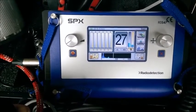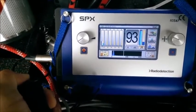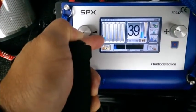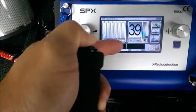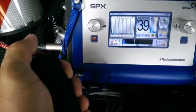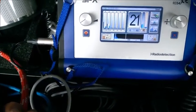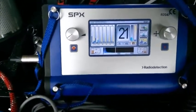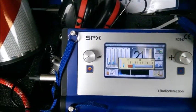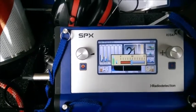The lowest noise level is the important value. Letting go and pushing again, you can see the history building on the left side — a top number of 27, a lower number of 14, current number coming in at 39, and a 9 for the lowest level. Toggling again, the history continues to build as I listen at different locations. Over on the bottom right of the screen, I can adjust the acoustic sensitivity level of the microphone — making it more or less sensitive depending on conditions.